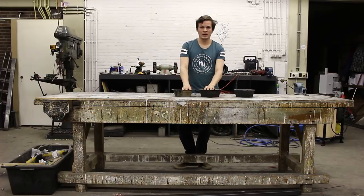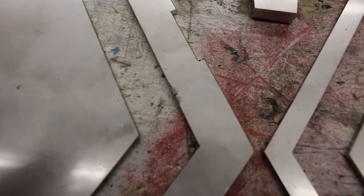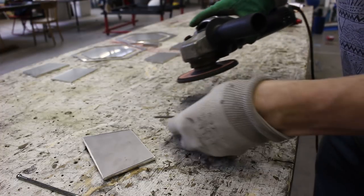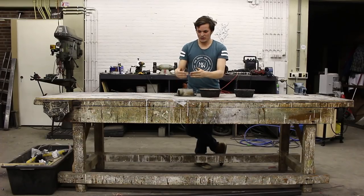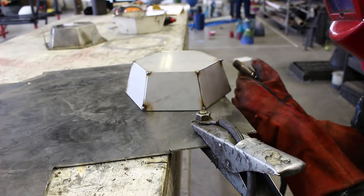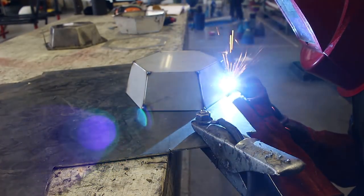Before making the mold, make sure that you separate all the parts so it's easy to recognize them, and then remove all the brims with the angle grinder so it's easier to connect them together. Start with welding the small bowl — just take some plates and weld the points together.